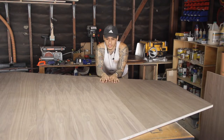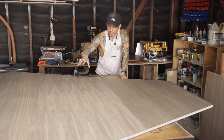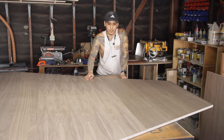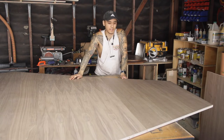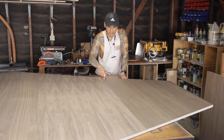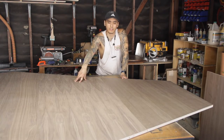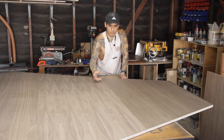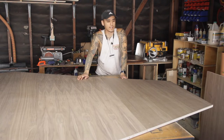I have the first layer cut out and it's looking great. The work's going by pretty easily since I have those templates — just rough cutting it out and using a flush trim bit on the router. I'll do the next layer the exact same process. There will be two sheets stacked on top of each other, the exact same shape, laminated together. For gluing, I'll dump a whole bunch of glue on and use half inch or even one inch dowels going in pretty deep to support the seam.